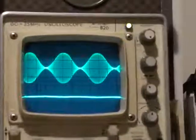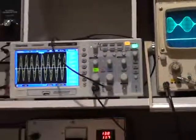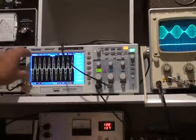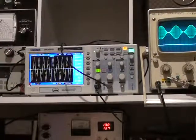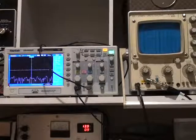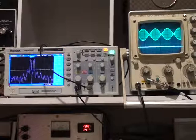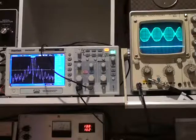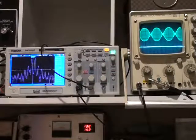That's the envelope and the sine wave. These peaks are reaching nearly 8 volts, which actually represents over 100 watts. This is the intermodulation distortion at this level. If I keep pushing the drive up, we've now hit about 140 watts — you'll see the waveform flat topping.